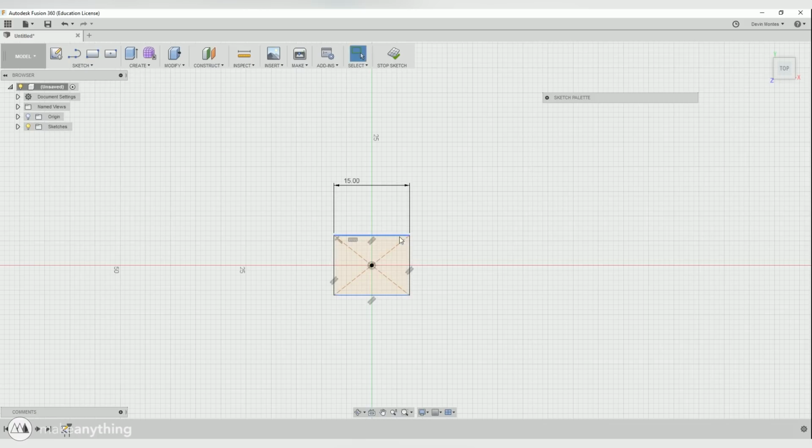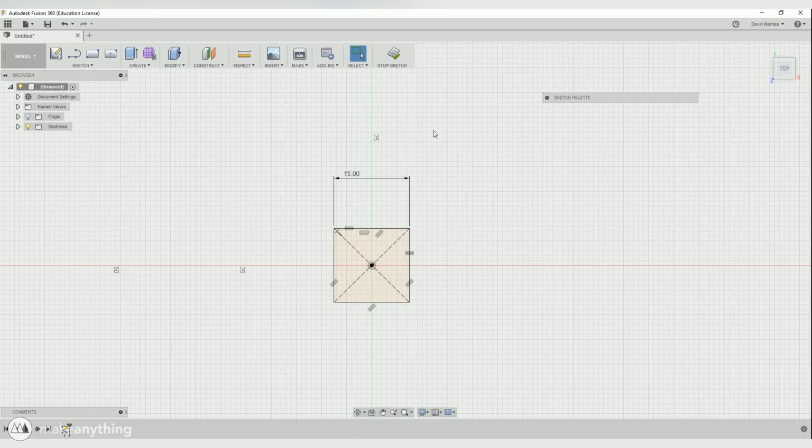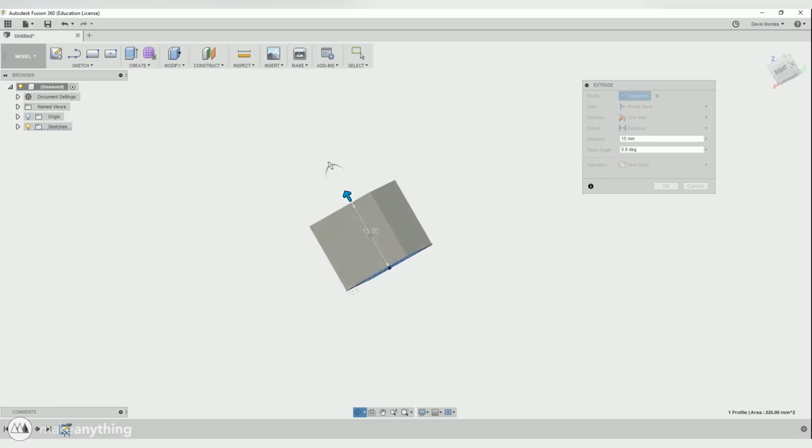And then this second side we could also dimension, but instead I'm gonna select both of them while holding control and then add the equal constraint. That way, if I change this one to 20, all the sides change. So that's just handy for making adjustments. So we made a 15 millimeter square, and the next thing we're gonna do is stop the sketch and click this extrude button, select the square, and we'll extrude that 15 millimeters as well to create a perfect 15 millimeter